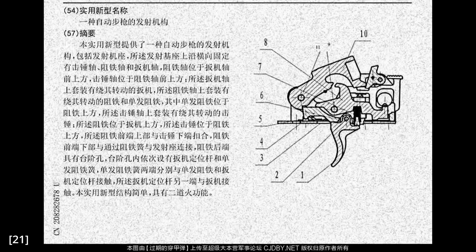Now let's look at the fire control group. And well — that's an AR-15 trigger pack, AR-15 hammer, AR-15 auto sear, and AR-15 disconnector. The tail of the disconnector is a little different because the order of firing modes on the QBZ is different, but still. There is also a two-stage AR-15 trigger where the sear and trigger blade are two separate pieces. One additional piece is present whose function I couldn't determine. I also mentioned that the QBZ-191 probably does not have a burst mechanism, and I came to that conclusion because I don't see any ratchets in the fire control group.